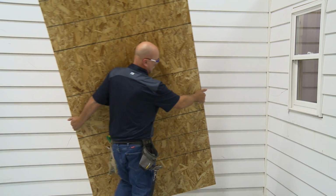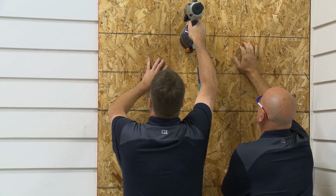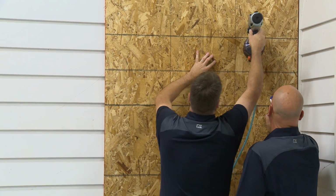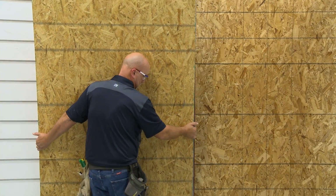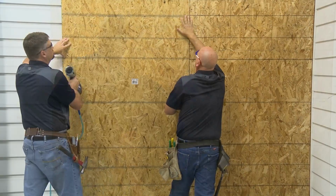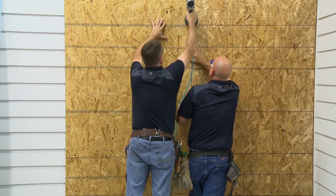Option 2. Apply rigid sheathing to existing wood siding to provide a smooth surface. Nail securely to the old siding. Nail evenly to bridge low spots. Note: failure to establish a smooth, solid surface constitutes misapplication under the terms of the warranty.